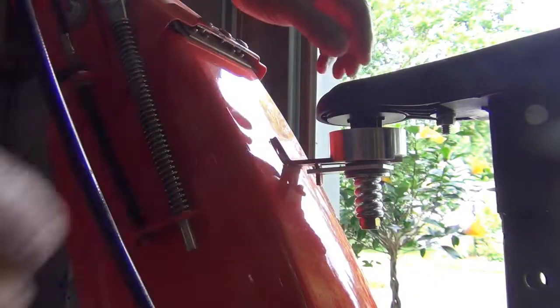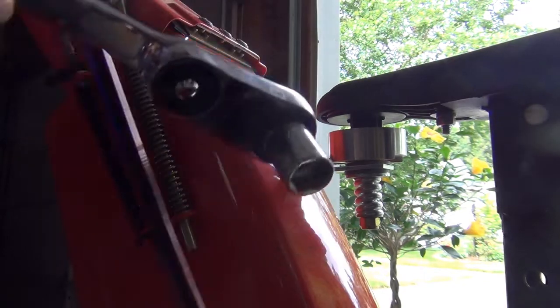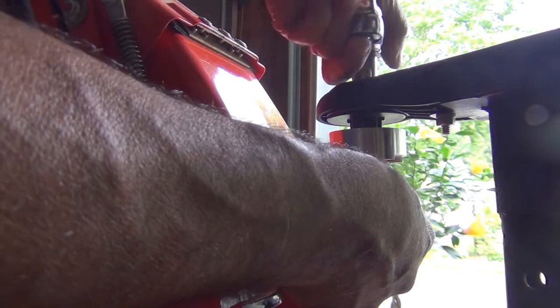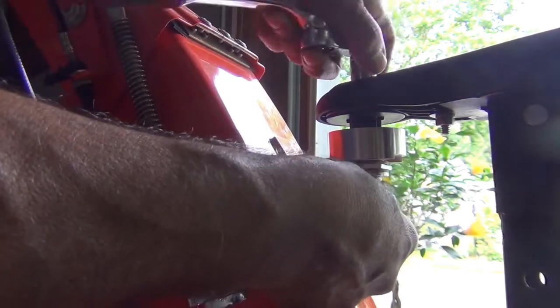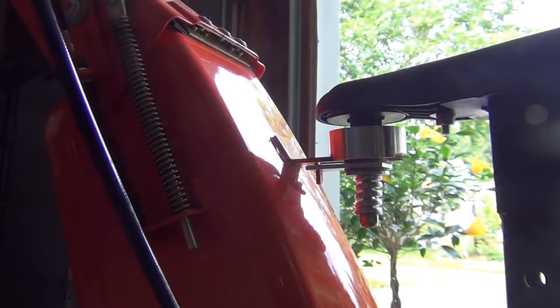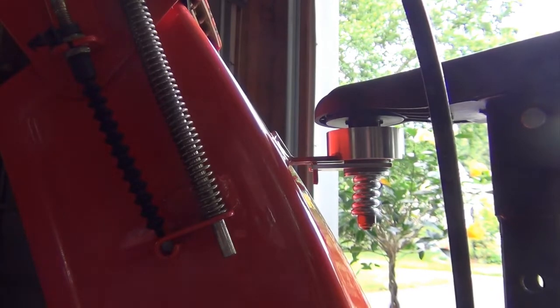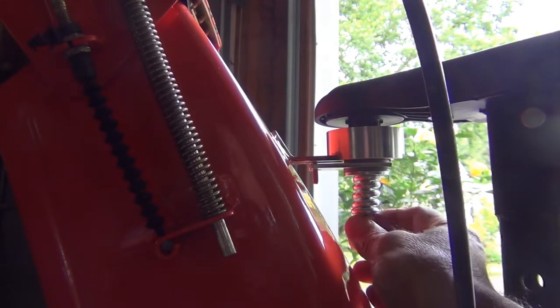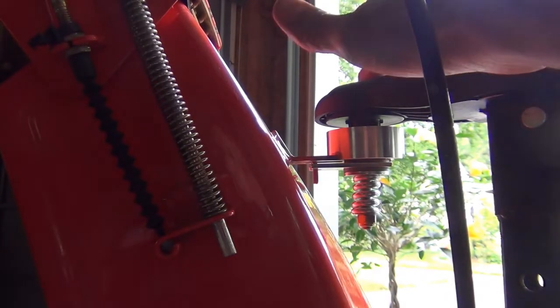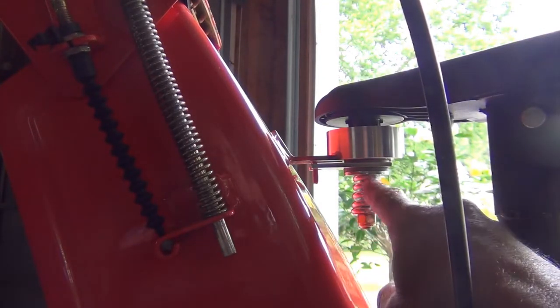After installing the lock nut, we're ready to tighten using the socket wrench. We'll use the 1/2-inch socket wrench on top and the 9/16-inch wrench down below. Tighten the fastener all the way. When you tighten the fastener and lock nut, notice how the fastener is visible through the spring. You don't want to tighten it too much. If you tighten it too much, then the chute is not going to rotate easily. You want the chute to freely rotate when you pull the cables.